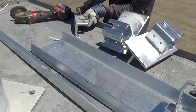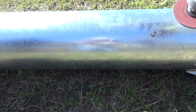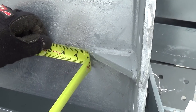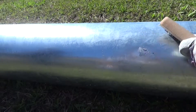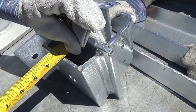Touch-up and repair of galvanized steel is simple, whether in the galvanizing plant or in the field. The repair methods are the same, but in-plant repairs have strict size restrictions found in the ASTM specifications. Field repairs should be kept to a minimum where possible, but there are no specific size limitations on repair area.